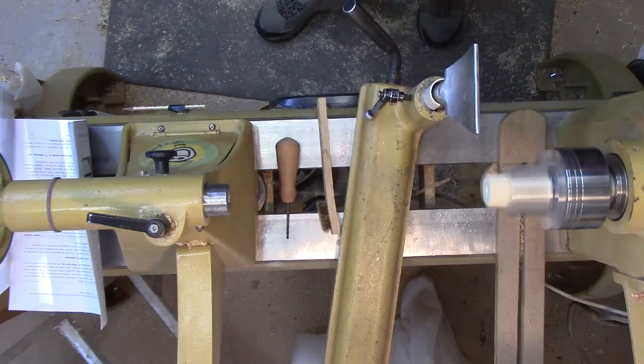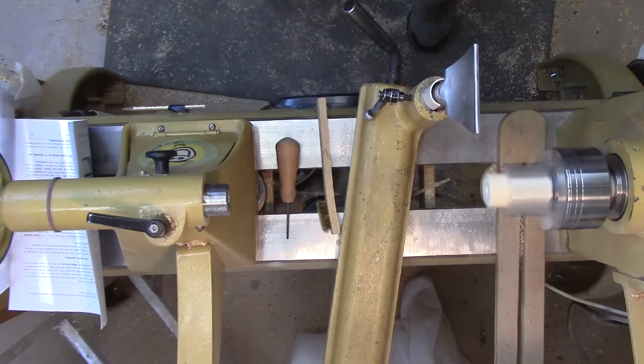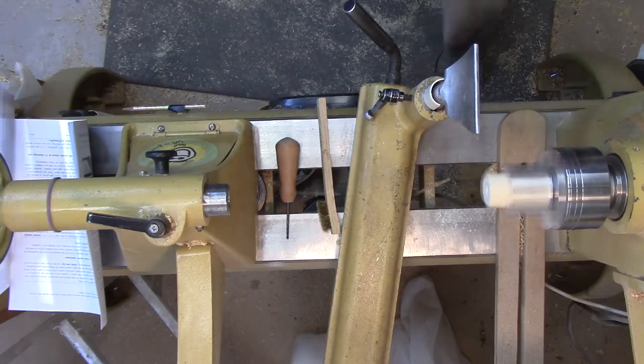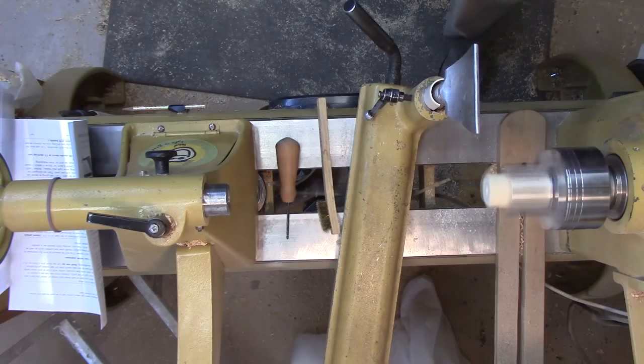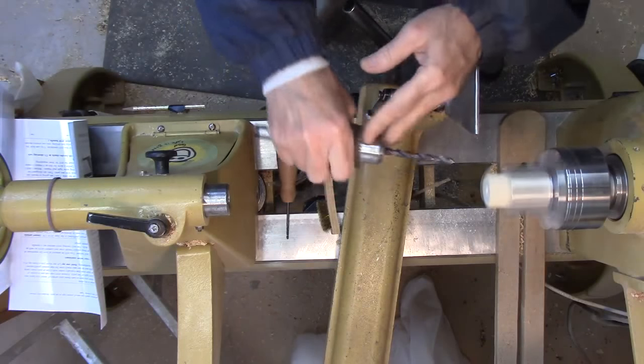That's how it works. If you really want to speed this process up, make a couple of dedicated handles. Another alternative: if you have a spare Jacobs chuck, put one drill bit in one chuck and the other drill bit in the other chuck and use the Jacobs chuck as the handle. I have one that's keyed and one that you can hand-tighten. I like the hand-tighten one, but this other one works well too. So we tighten that up — this is a 5/16 — and just go back in and re-drill that hole.